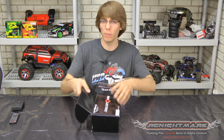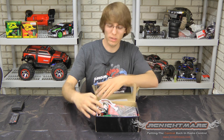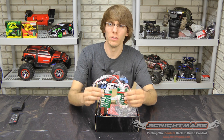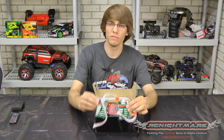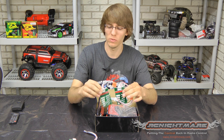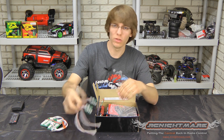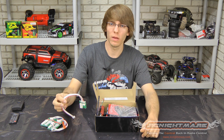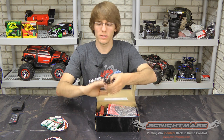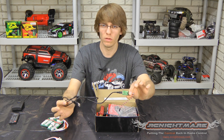This is the two combo pack that you can buy from them. The combo pack gives you two balancing boards — these are their smart balancing boards. They have built-in fuses in case you miswire something; they're resettable fuses, so they'll go off and you'll know if you got something set up wrong. They also give you their standard FMA balancer, and this has the USB adapter to hook the charger up to the computer. Full kit there.